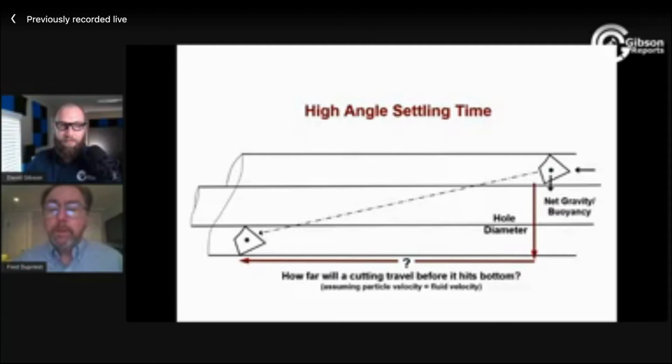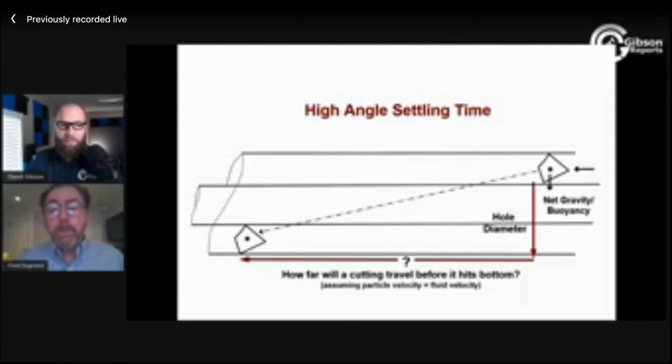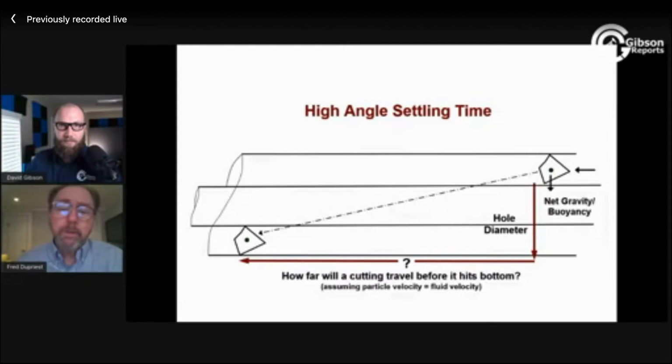If it's in the sand and you lose, you might be able to stress it up a little bit. But if it's an impermeable shale where that's happened, LCMs don't work in shales. We don't have any answers that work to stress up a shale. So you're really getting into a very big, and as we all know, a contentious area of discussion around how to manage holistically and logistically the lost return scenario in a given well. But that's what I would focus on.